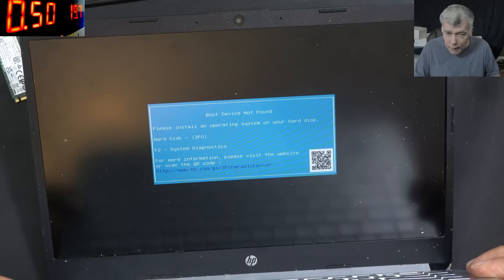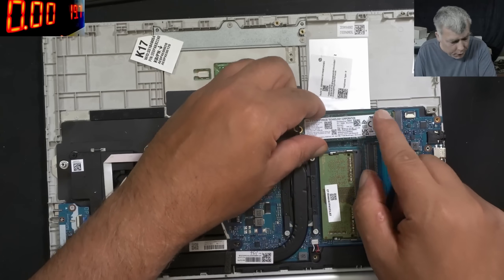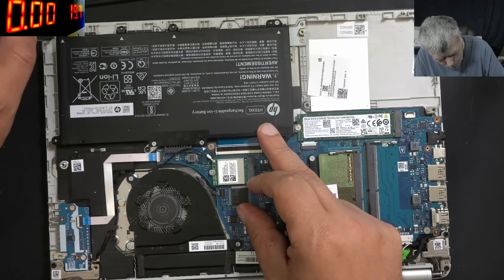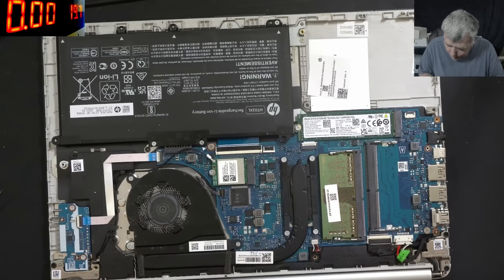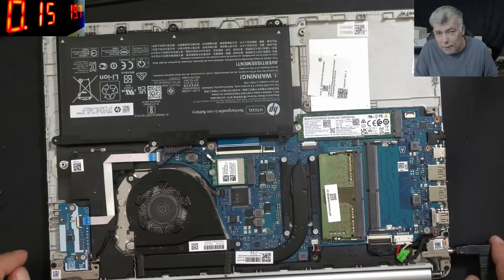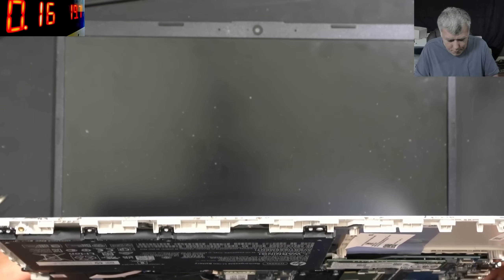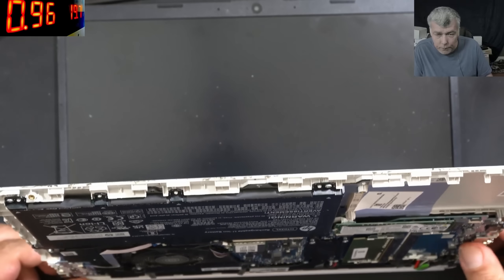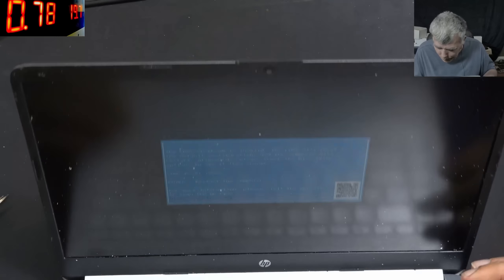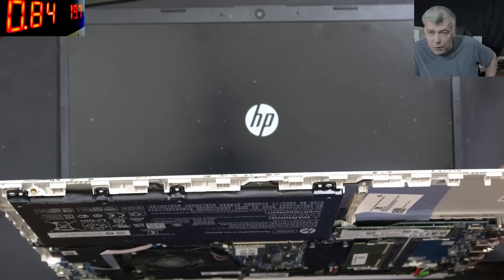It's too hot outside. No hard drive — yeah, that's fine. Let me put it all back together, just to be sure it's working with everything — with the hard drive, with the Wi-Fi card. Everything is back in place. Let's test one more time, let's see if it's charging also. It is charging — pre-charge current. 90 milliamps, 150 milliamps, and probably going up. That's the pre-charge current, so the battery is very discharged. Let's press the power button — the laptop is coming on. We have picture.